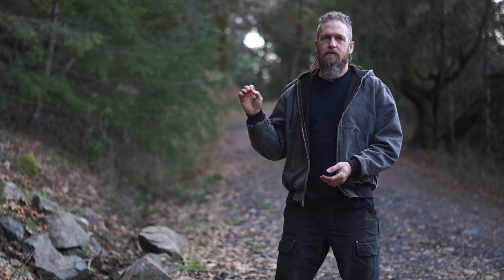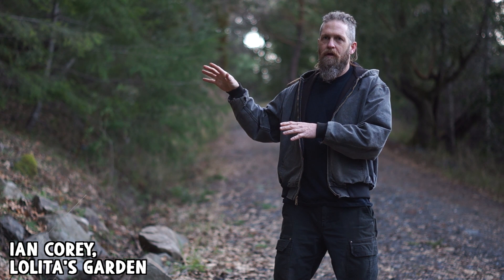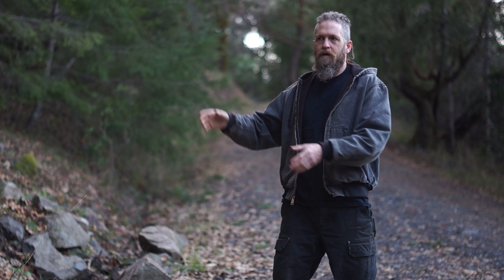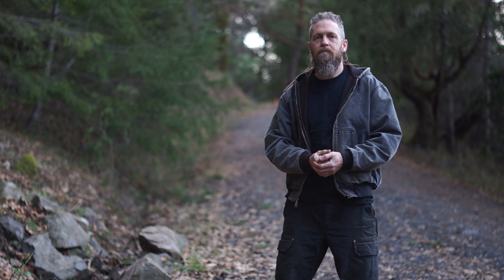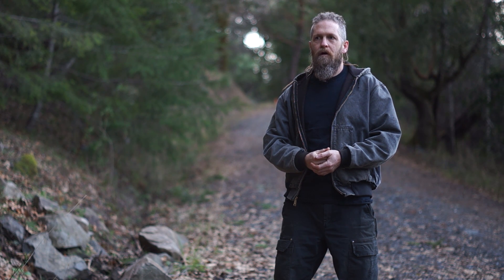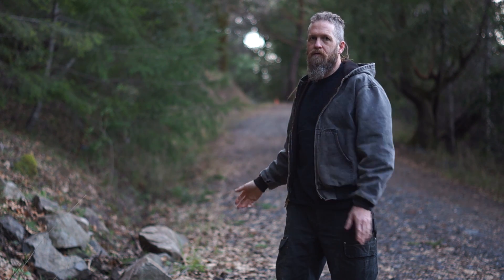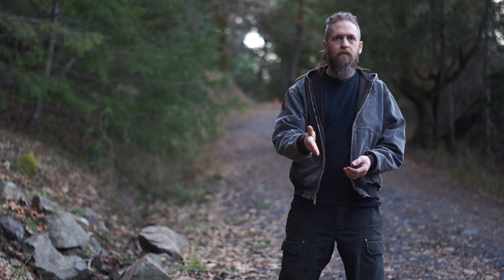Ian Corey from Lolita's Garden YouTube channel left a comment asking: if you don't have a ditch, what's the difference between the water jumping out of a ditch and just having a bunch of water come off your hillside and run across your road and screw it up? The answer is that there are areas where water does not come off the hillside. From here down for hundreds of feet, there's virtually no water that ever makes it off this hillside onto the road.